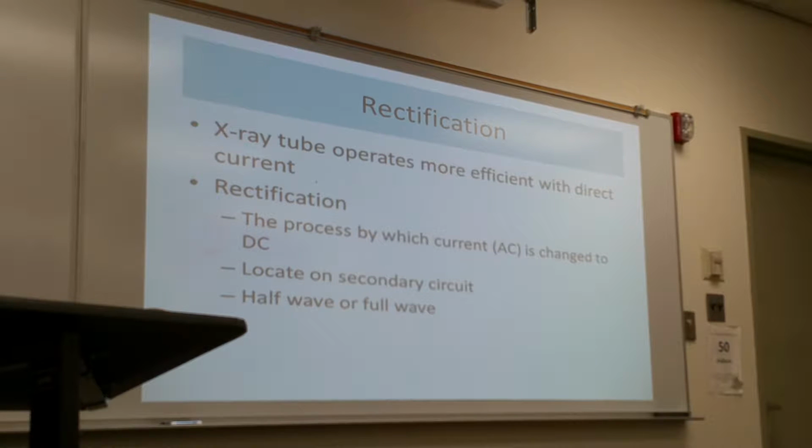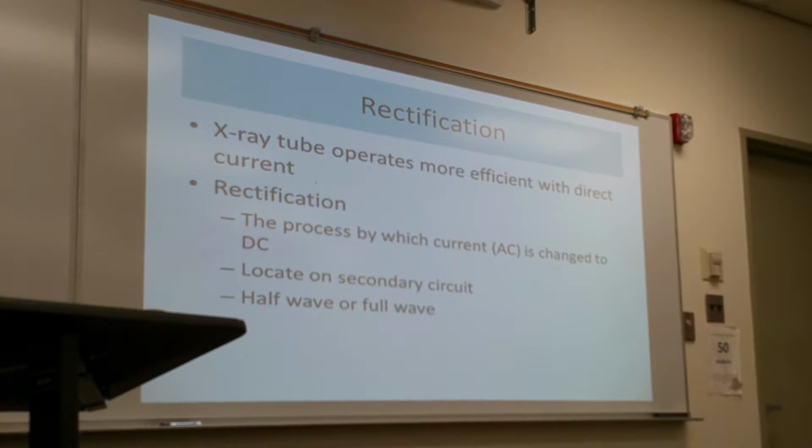Okay, we've been talking about rectification a lot. X-ray tubes, as I mentioned earlier, work more efficiently with direct current, DC. However, the power supply that the X-ray imaging system receives is AC, because the hospital gets electricity from the power plants, and the power plants generate AC electricity. In order to convert from AC to DC, you need a device known as a rectifier,